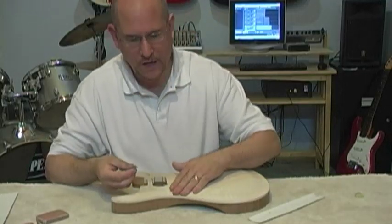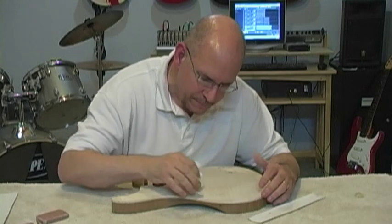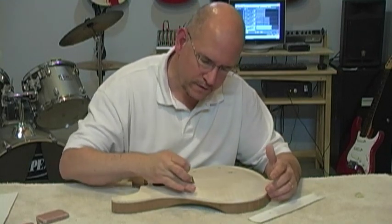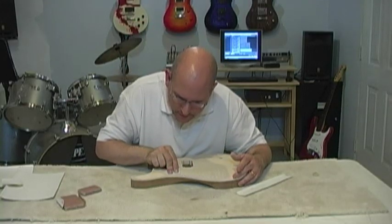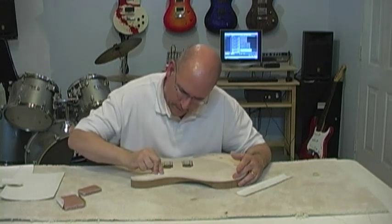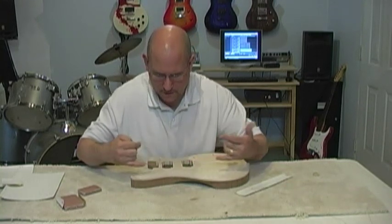Now because of the shape of the wood, pulling this direction is going with the grain. If I was to be going this way, I'd be kind of going uphill and therefore against the grain. So when I sand this direction, I'll stop here with strokes in this direction and I'll come in this way from up here. Once again, keeping in mind how those ends of the grain fibers end when they come out of the wood.